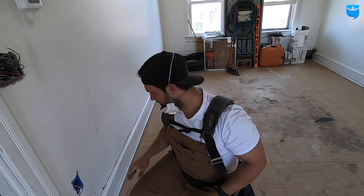Now, all of these houses we've been doing all have this base cap. So, even though I'm not keeping this baseboard, if you're gonna be investing into one specific area, try to look for things like that, where I know that these base caps were made at Camden Mill Yard that is not there anymore. You can't find these base caps anywhere. The only option is to get a knife made and to get a massive amount of linear feet made of that cap. So if you only need less than 100 feet of that cap, it's gonna cost so much, it's not even worth putting that money out there. You might as well just rip it out and put new in.